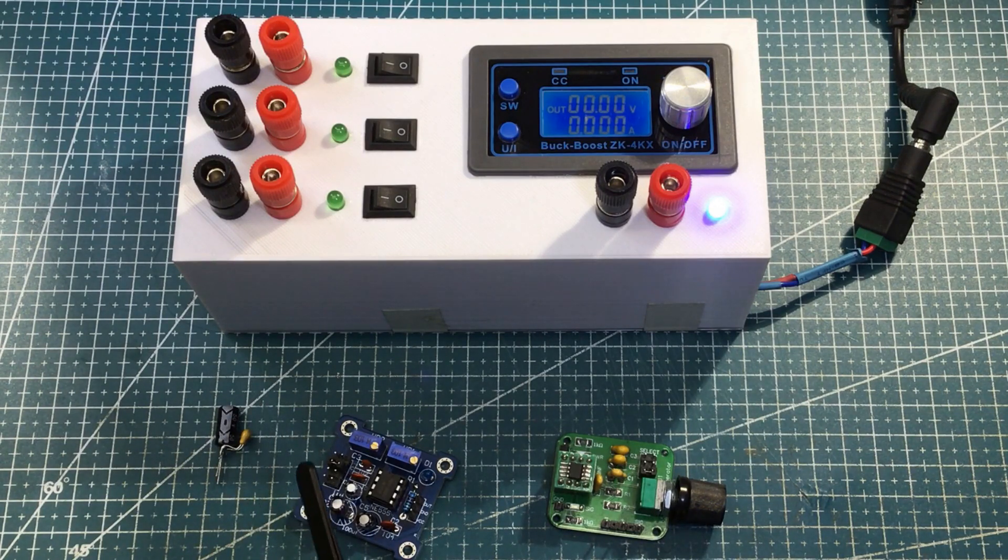And what I might also do is put this capacitor combo in here. This is a 47 microfarad capacitor, and it's got a 100 nanofarad capacitor attached to it as well. So that should add some additional smoothing.